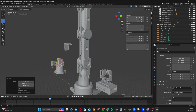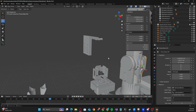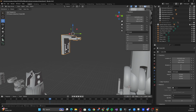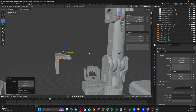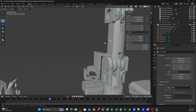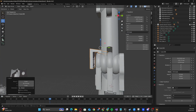Of course the stepper motors go on the side where the square attachment is on each one. And after you put those in and then you put the magnet on that, I included these. This is where you put the encoder, with the chip facing forward, and you can wire everything up from behind. These plug in directly into these holes that I added on this side. I don't really remember if I added them or if they were already there. But you put these here, you plug them in there, and once you plug them in, it should hold.